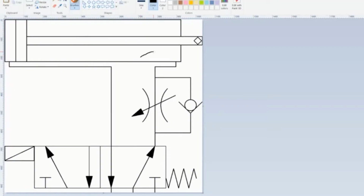Okay, here we go. What's going on is that we know the flow is throttled by this guy. Now, what's this guy all about? Well, it's because we want the cylinder to move this way without any restriction. So the air that's going to come, let me draw the air in blue, comes this way, and there's restriction here, so it says forget about it, I'm going this way. It sees this is wide open, so it goes this way and this way and this way, and makes this thing move this way. No problem. It's going to move very quickly.